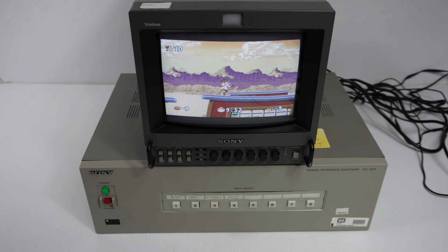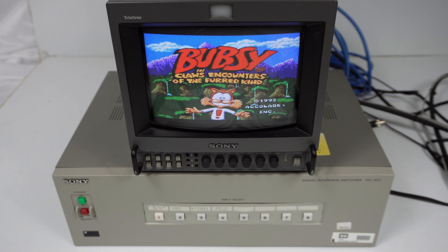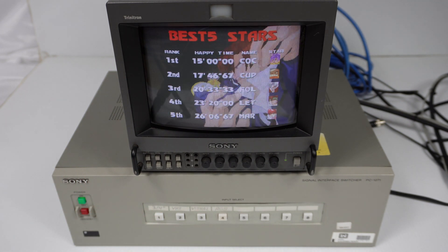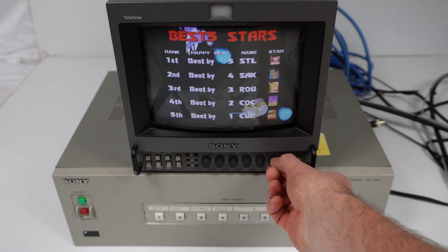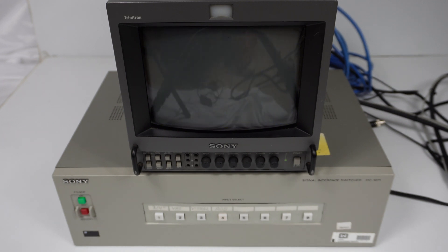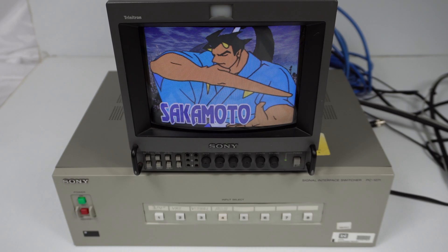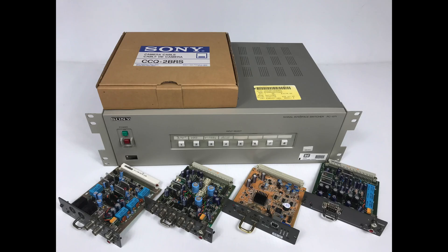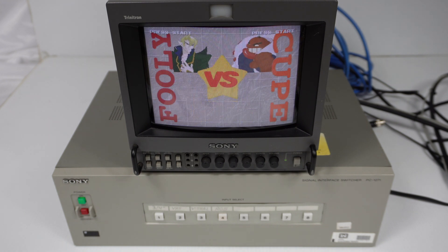Now I'll do some RGB. The Super Nintendo is still plugged in for this final demonstration, still in S-Video. However the Saturn is in RGB this time. I'll switch the monitor to RGB and internal sync, and then switch the switcher over - and we're in RGB with the Saturn. The cabling requirements for RGB are far more extensive than S-Video, and the nightmare of cables at the back is like a bird's nest. To sum up: you're probably better off just getting a SCART switcher - much smaller footprint, you've probably already got SCART cables, and there's no need to convert everything into BNC. However, where the switcher might be ideal is where it's intended to be used: with projectors, rear projection units, a direct hookup with the camera cable, a combination of cards including an HDMI card. If you've got all the works together, you're probably better with the switcher on the matching Sony projectors. Thank you for watching, see you in the next video.